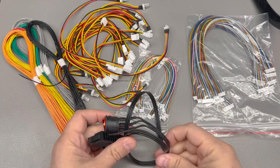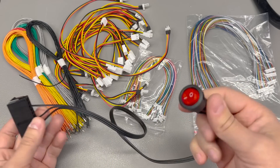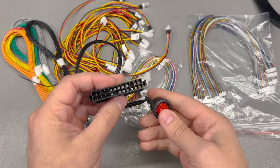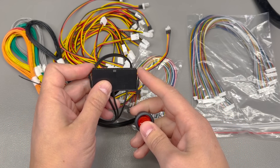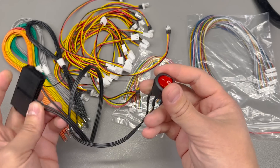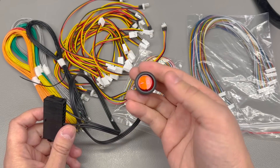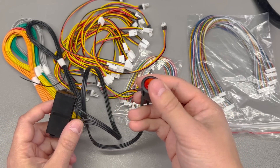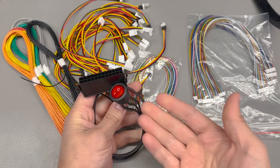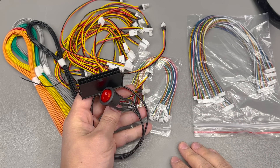Also in the wiring department — this is an ATX PSU power-on switch. It gives you a female header that connects to your ATX PSU harness, and on the other side you get an illuminated switch that shorts the power-on signal to ground to turn on the PSU, in a nice safe way. This is really useful if you do any kind of work with ATX PSUs outside of their original intended purpose.